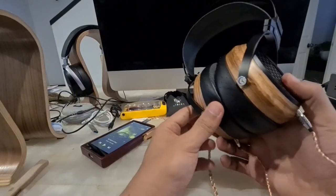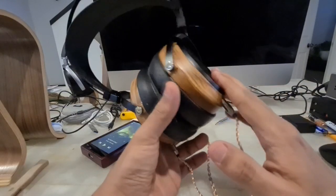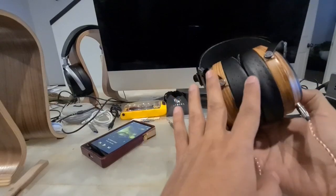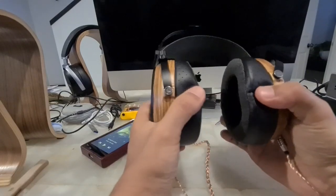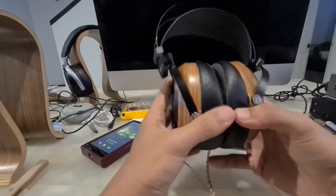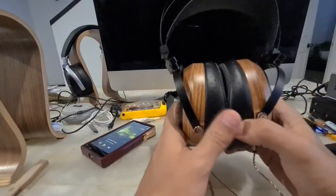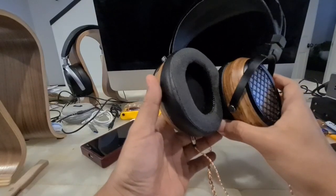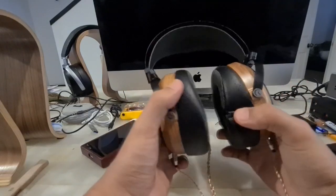That's why I decided to do some in-depth research on the behavior of planar magnetic drivers. And what I discovered, analyzing the cavity acoustics, is that if the earpad you put on is more porous, the bass will increase. This is the opposite of what happens with dynamic headphones — with those, a less porous earpad increases the bass. Here it's the reverse: if the earpads are porous, the bass increases.